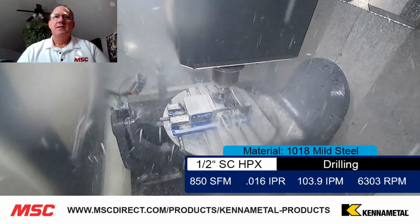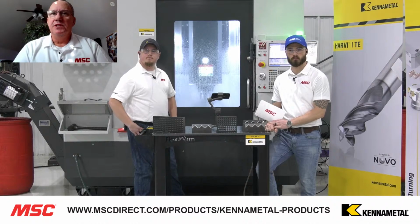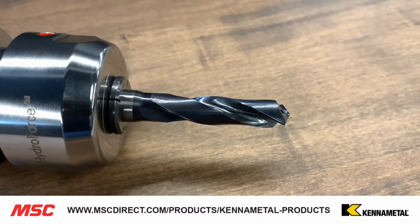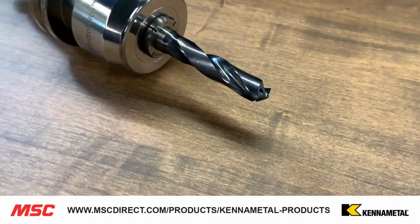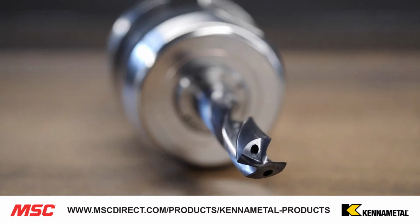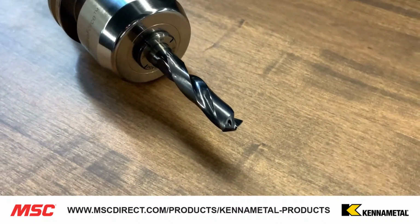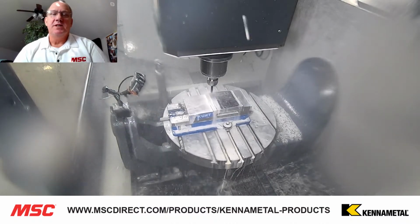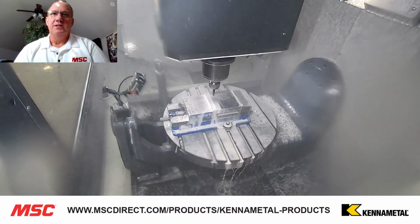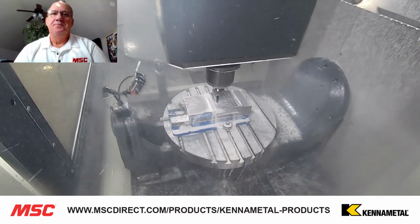So when it comes to this specific drill, how does the HPX compare versus other solid carbide drills in the market? Well, again, it is a very high precision, patented design, so it's material specific. At Kennametal, we have some very high precision tools that we make more material specific versus general. In alloy steel, which is what we're running here, whether it's your soft steel, your tool steel, even PH stainless steels, you could run this drill in. So it gives you that flexibility across the spectrum of steel product. To me, it outperforms pretty much any other drill out there on the market. As you can see, we're getting through these holes really quick, and the precision of the hole, the diameter, and the roundness of the hole are going to be very precise.